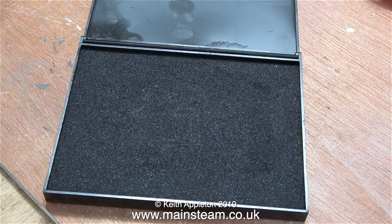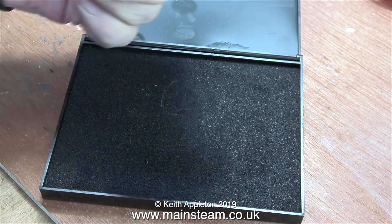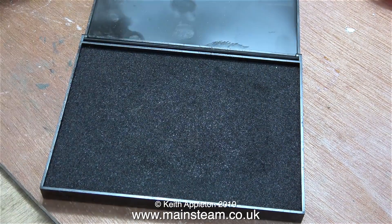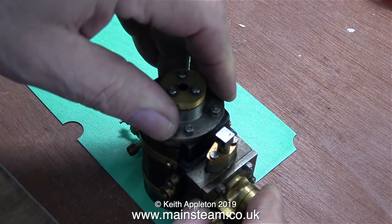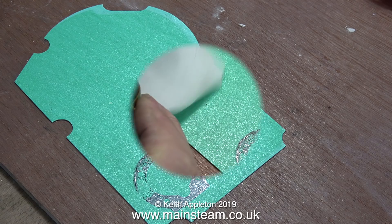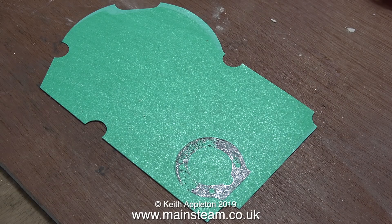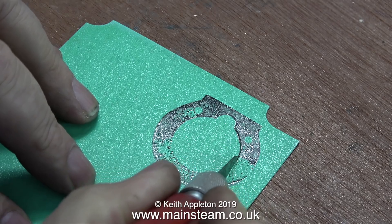Before I paint the base with some black enamel paint, I'm going to make a gasket. Normal procedure: press the component down onto an ink pad and make sure you get a very good coverage of ink on your component. The next step is to press the cylinder firmly onto a piece of gasket material, which is not exactly perfect but it's good enough. It gives me a shape to cut out and shows the positions of the bolt holes. It's a good idea first though to wipe the ink off the cylinder. Later on I will wipe off the ink from the gasket material, but not just yet.